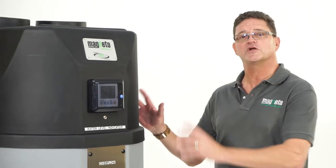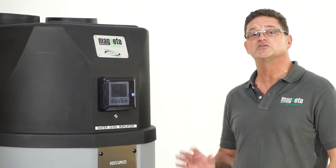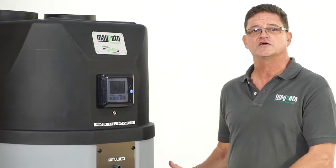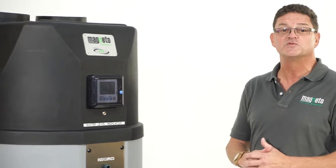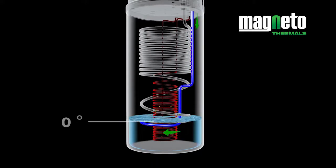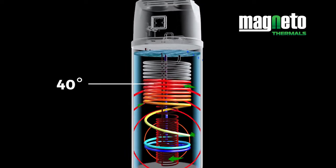The unit is equipped with a 3 kilowatt heat pump on top that heats the water inside the tank. This heat pump is connected to a stainless steel coil, and there's also a secondary coil inside the tank where your high pressure water from the municipal side comes through. It enters the coil, goes straight down to the bottom of the tank and then spirals back up inside the hot water cavity, absorbing that stored energy which is in the tank.